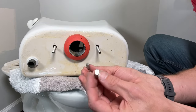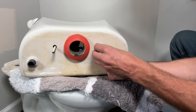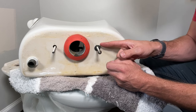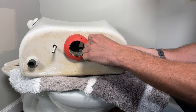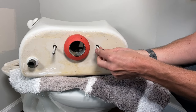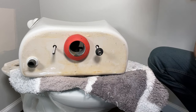You have two different options for mounting. The kit comes with two different thicknesses for the nuts. The thick nut goes on the bottom and that's what holds it to the bottom of the bowl. Optionally, you could place a washer on your bolt and tighten the thin nut prior to mounting the tank on the bowl — that compresses down the gasket, and the tightness of that thin nut determines the compression on the gasket. I don't prefer that method, and it is completely optional. What I'm going to do is keep the bolts loosely held, mount the tank to get a good seal on the bowl, and then from the bottom side: gasket first, then washer, then thick nut.